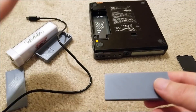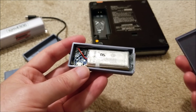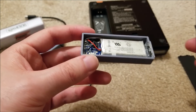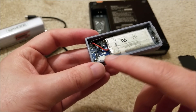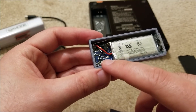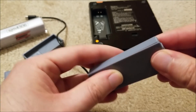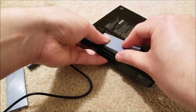Hopefully you enjoyed the video. This is definitely a valid approach if you have old devices whose batteries are no longer available. Just take some calipers, measure the original battery or the space inside the device case, grab an old iPod battery or a cheap replacement — they sell for dirt cheap. Then use one of these LiPo USB charger boards from eBay — you can get them for around 77 cents each or a five-pack for two or three bucks. Design a way to connect it — in this case a custom PCB — and you're good to go.